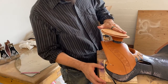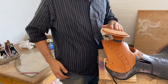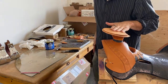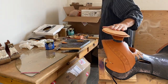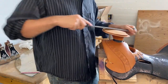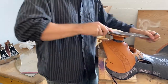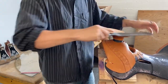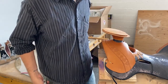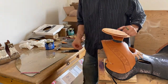Now, if you're making something, a nice horn, okay, and it's not gonna be covered with a metal cap or something like that, what you wanna do is get rid of those bumps that your hammer created, because otherwise you have a princess and the pea scenario where that bump is gonna be exaggerated in the next layer and then the next layer. So you want this as smooth as possible at this point. All right.